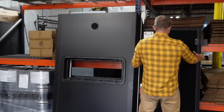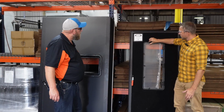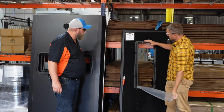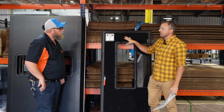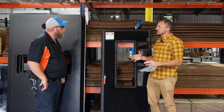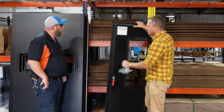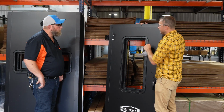Yeah, that's awesome. So this is a new window for us this year. Actually, the display you saw over there was our 2023 model. This is what we're launching for 2024. So we've added some simpler turns. We've gone to a one-piece injection molded piece. What that's done is really helped save us on our manufacturing. Our previous style windows, our operators would have to touch 64 different pieces in order to build up that window. With this, we get them in from our injection molding manufacturer, we drop them in, and 10 rivets later, this product's assembled. So we've been able to get out a lot more product with the simplicity of that window.